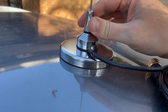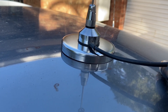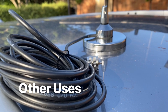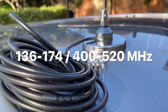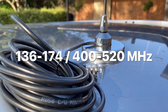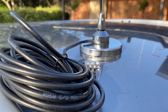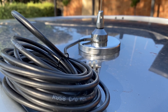The best place is in the centre of the roof, but you might want to put it on the side so you don't have as much wind resistance with the cord — up to you. This antenna is optimally made for between 136 MHz and 174 MHz, and also 405 to 520 MHz. That's quite a bit bigger than the amateur radio bands, so this would make an ideal scanner antenna as well, just for receiving — something to think about. It takes 50 watts.